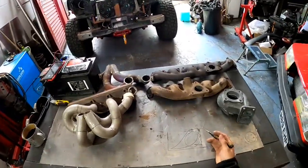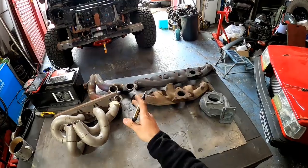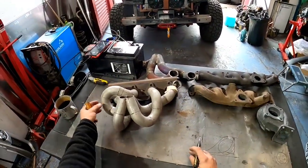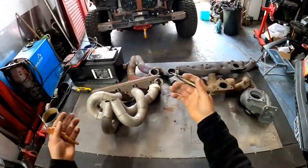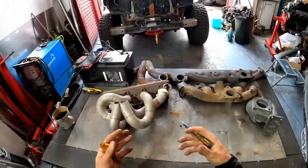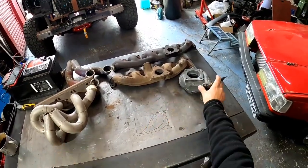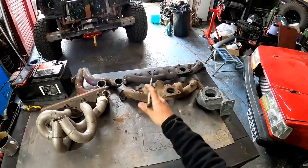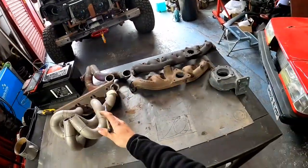When you build a proper plenum, you bring the air equally through all 6 cylinders, and then you extract the gases roughly equally from all 6 of them, so they have the same back pressure, the same intake pressure, all the stuff, so they all work together. And this is the thing: you have to stop making them argue between each other. Make them work together for you, and they're going to work efficiently, okay?